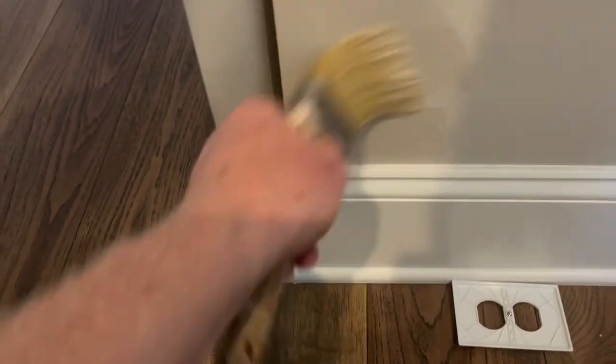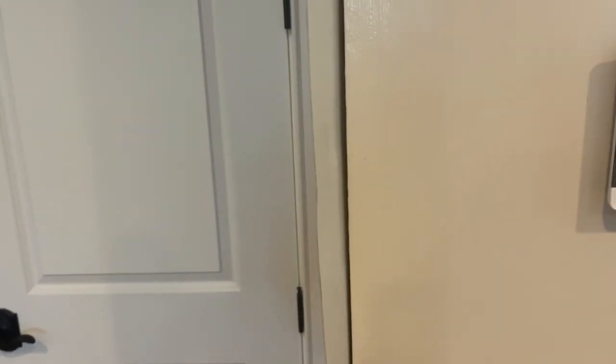So that corner wasn't easy fixing before I went on video. I had a lot to do, and anybody who hangs paper, look straight ahead. You already know that putting grass cloth inside of that 1¼ inch of space is not easy. Not easy. So I left the outside corner for the end of the task of putting the sheet up. Okay, lots of paste in there. Both sides. Okay, get that paste in there, work it in. I'm telling you, this will prevent your fat corner.